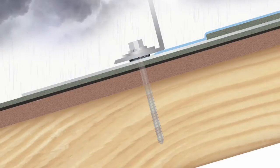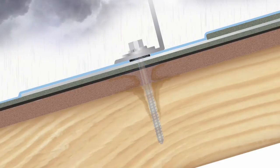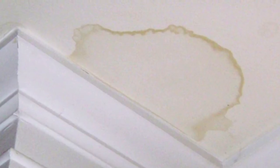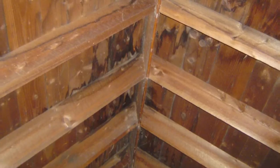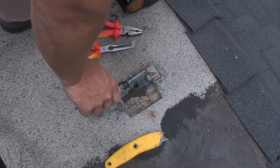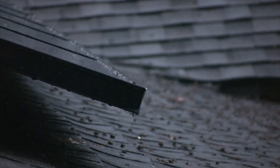Failing to consider this long-term problem, many solar roof mounts seal the penetration at roof level, exactly where the rainwater will be running down. Water seepage through a damaged rubber seal is likely down the road, which can lead to rot and mold, requiring costly removal and remounting of the solar array and possibly even a new roof.